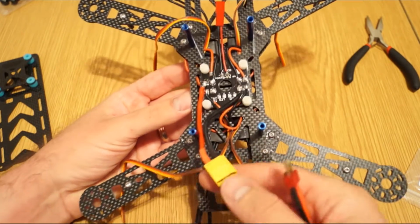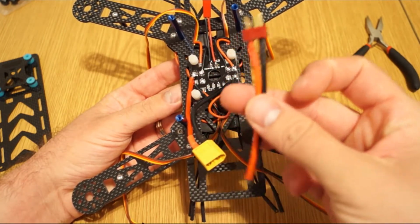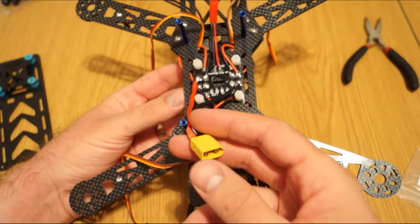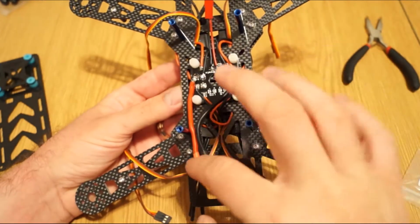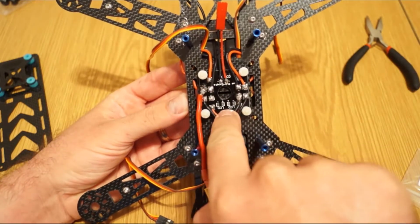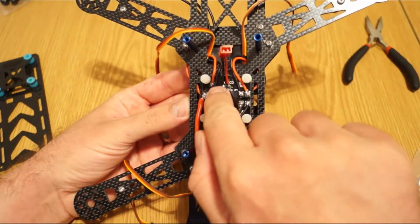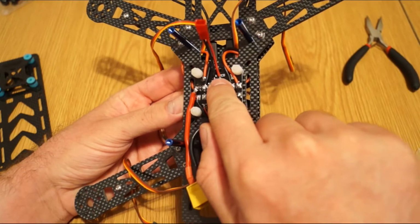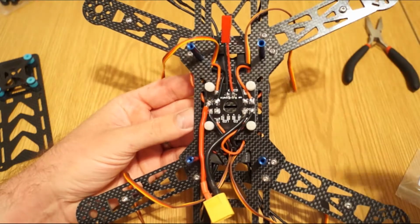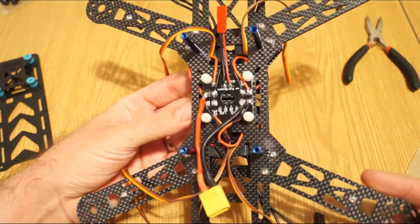So this is the main power. I use an XT60, not the socket provided with the kit. I don't have batteries for that anymore, so all my batteries, quads and helis are on XT60. It's really simple. You have everything labeled with plus and minus, and here on the bottom you have LED. This is where you can put the front and back LEDs for the quad for visibility. And here you have TX CCD, so there's another power output option for maybe your video transmitter or some other gadget you want to install on the quad.